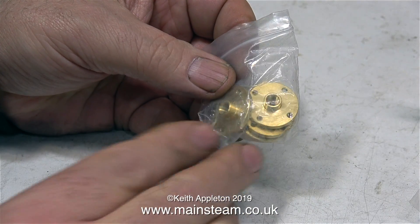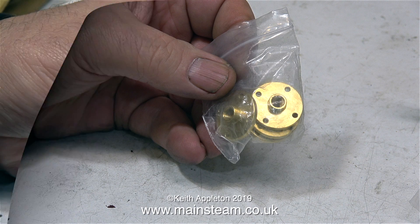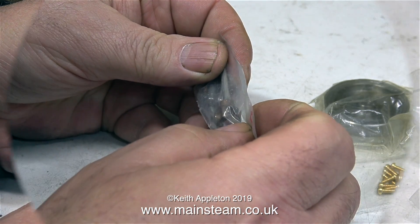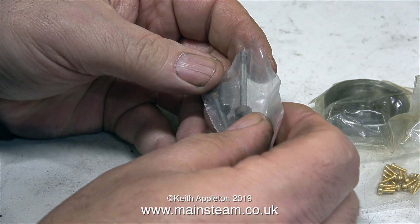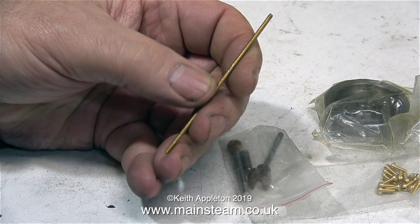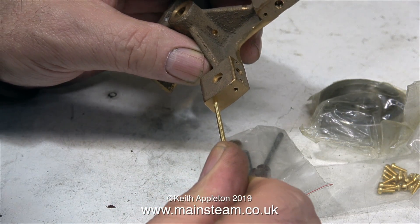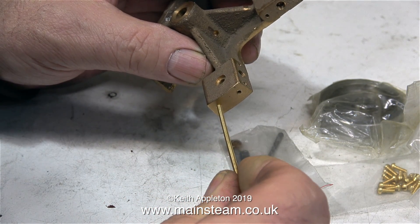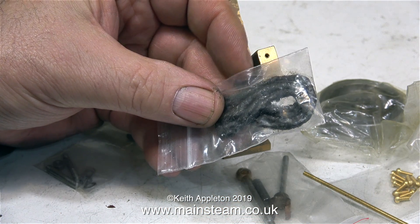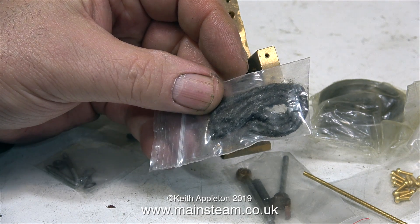Opening another plastic bag, you can see the cylinder covers, top and bottom. Here's the flywheel, ready to fit to the crankshaft. In another bag are the connecting rods, complete with the big ends. There's also a piece of brass studding to block up the holes in the top and side of the standard. And last but not least, some graphited yarn — by the look of it, quite old. This is for packing the piston and the glands, but I think on the piston I would use an O-ring these days.